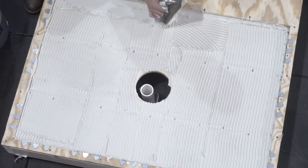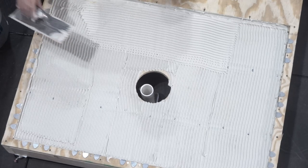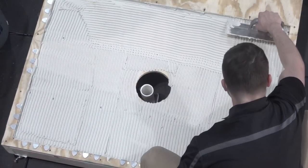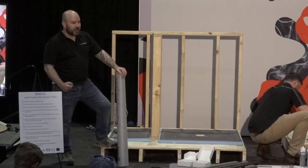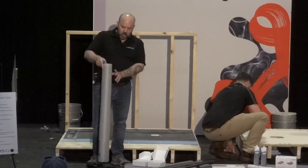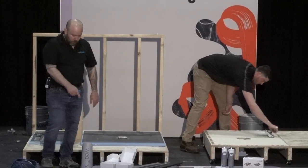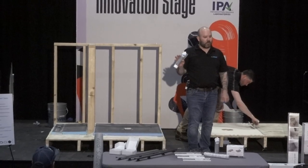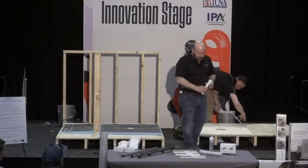There are a couple of products I want to show you. When doing our curbless installation, Subliner Dry is part of that — our fabric membrane, also good for steam showers. Check out our Vapor 85 panel as well: a new panel available in a 3-foot by 8-foot size with the Subliner Dry already adhered to it. Steam showers operate differently than regular showers, so look into the Subliner Dry and the Vapor 85. This component is also part of the Ligno installation — after the base is set, you use a portion of the Subliner Dry membrane to cover the threshold area. That goes into place with thinset, and we also have the 620 sealant for use with our membranes — all in the technical handbook.